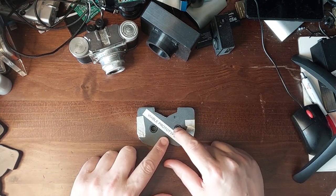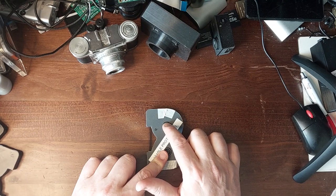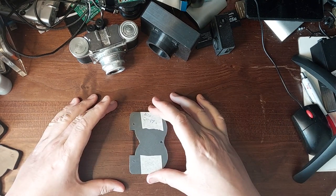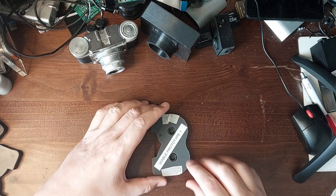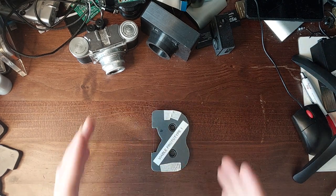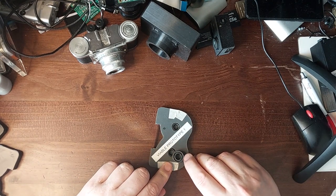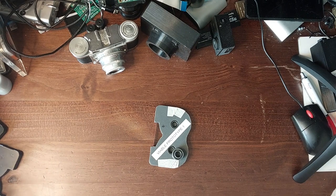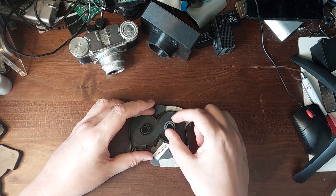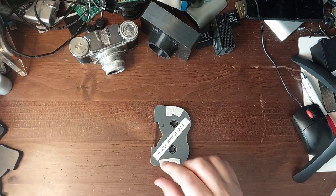The reason it didn't work was friction. When you put it in the camera, as the cartridge is pushed against the film gate, the reel moves relative to the inside of the camera. What happens is the inside of that groove pushes up against the lip for light tightness — so it moves across, can't move anymore, and you get huge friction. I had to redesign my cartridge.